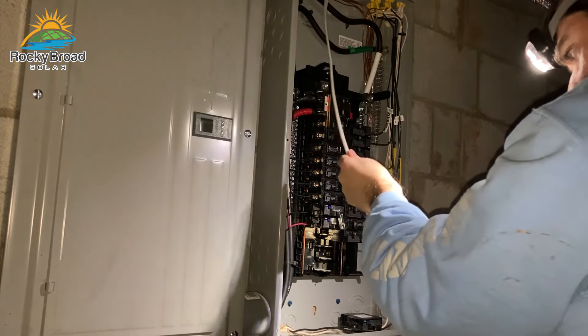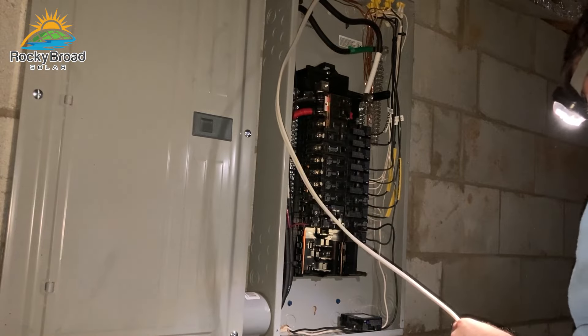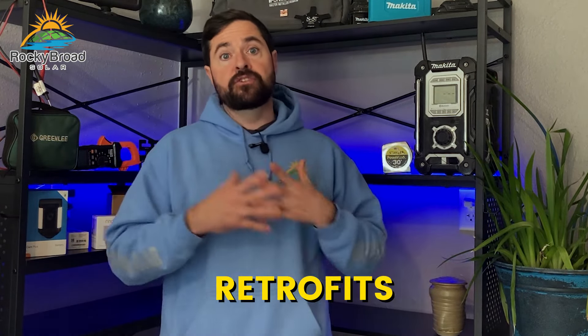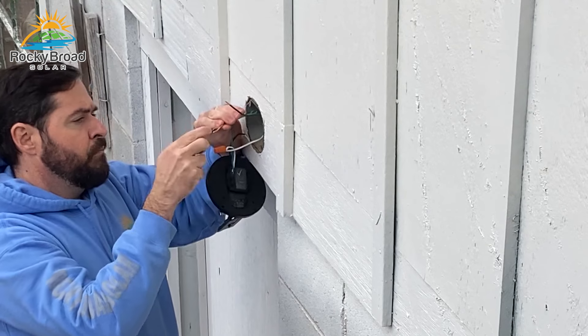For my project I installed a dedicated 15-amp single-pole 120-volt circuit for my security installation. The wire running from that 15-amp breaker ended up being 14/2 Romex. I used the old-work four-inch round box. For those who aren't electricians: old work is for retrofits, new work is for new construction. With an old-work box you drill the hole, put the box in, and use a screwdriver or impact driver to rotate locking tabs that squeeze onto your drywall or plywood.